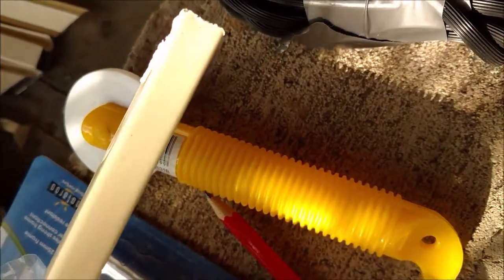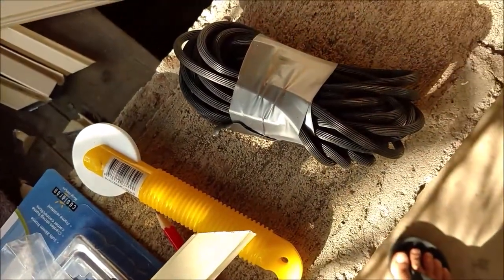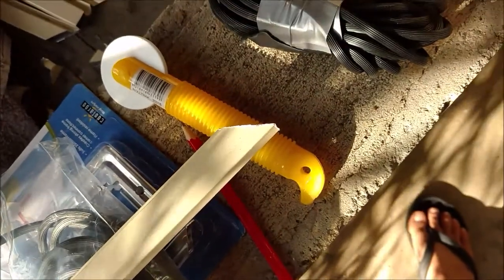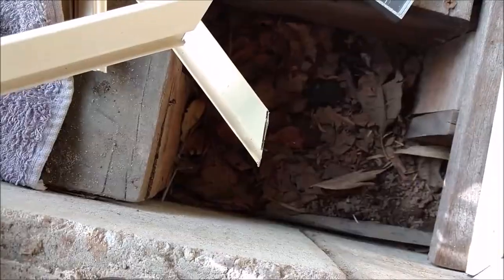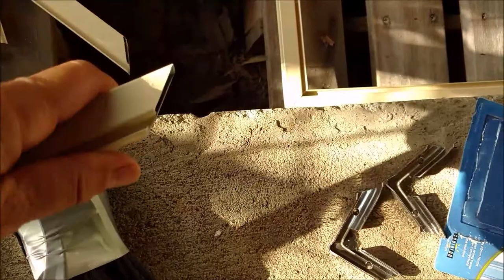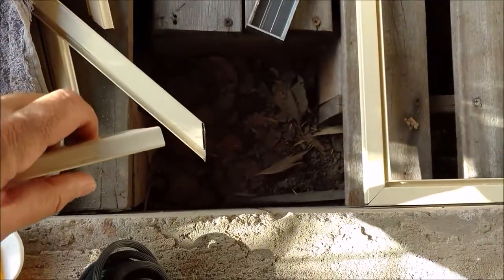Here I have my first piece that I've cut. You can see that some of the edges are a bit rough — it might just be the quality of the equipment I'm using, or the nature of the beast. But just a little bit of sandpaper on a small block, and you just sand off those edges. It actually happens really quickly. It makes it safer to handle later when getting in and out, and it looks better as well. They don't tell you that on the Mitre 10 website, but it just makes sense.